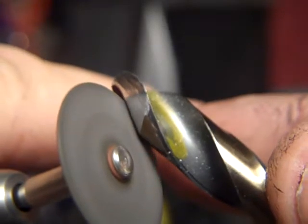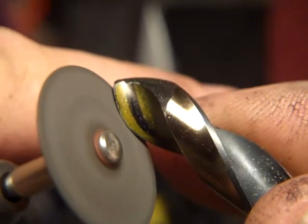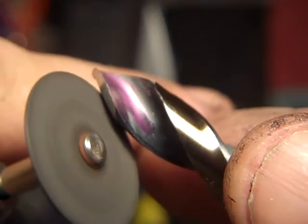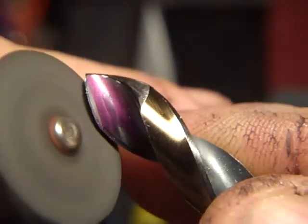This is a bullet point tip — I just hogged it off and this is how I do this. I start on the inside and roll myself towards the tip. I ground the profile in a lathe with a grinding tool, and this process here is relieving the cutting edge. I hogged off a lot of material to relieve that cutting edge. It's more of an art because you got to learn to sneak up and round that edge.